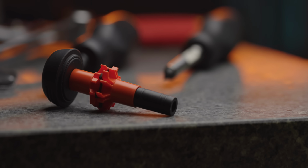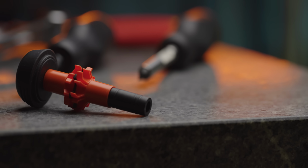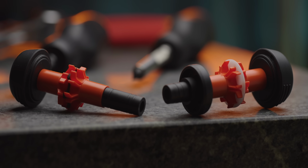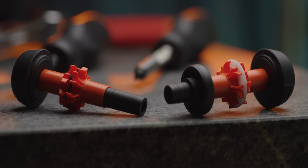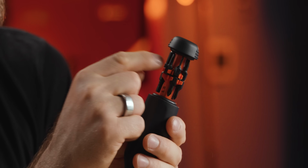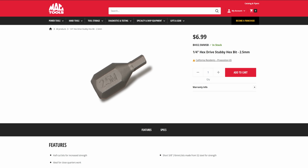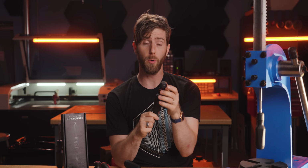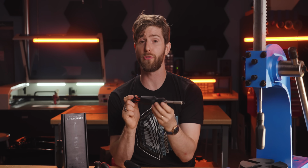And some of them matter a lot, like the revisions that we made to the Ninja Star. Originally, between the 2 rows of bits, there was supposed to be a round plastic washer, and this was to help hold the bits in place so that they couldn't accidentally slide into another position. Unfortunately, it limited compatibility to the 20mm long bits that we sell, or to less common 16mm bits from other vendors, like this one.